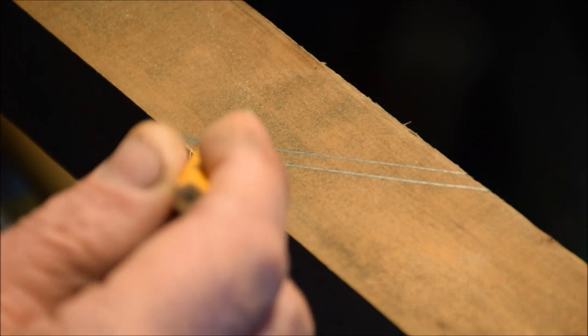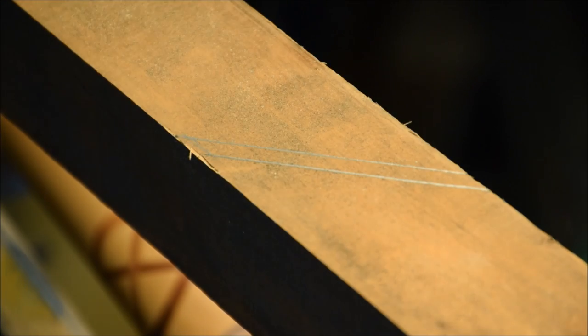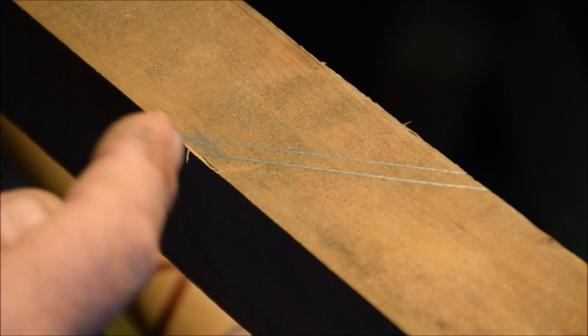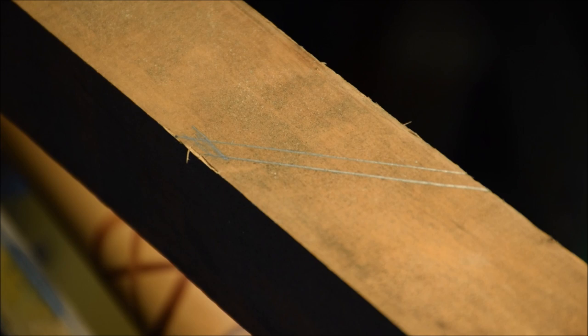I would make a chop saw cut and then glue in a strip of 1/8 inch thick material into that space, then clamp the piece up — which is much more challenging when you're not leaving a little piece of your board. On the chop saw, because it's a circular saw, I can't really leave a square-edged cut without going back in and removing material, at which point I might as well do it on the bandsaw. So I cut all the way through.